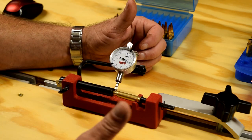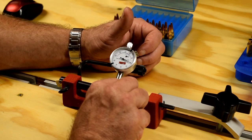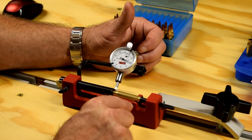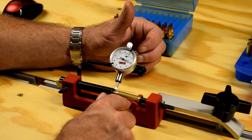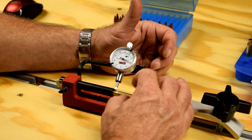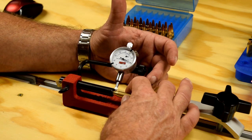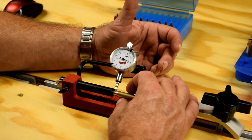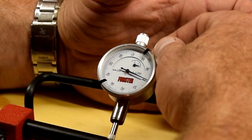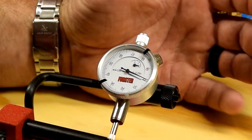I don't think zero for most of these measurements is that important — you're just looking for how far out it is. You can see the cartridge right now is not sitting down in the V. It's centered on here. If I pushed it down to the v-groove on this side, then it's going to be running a little bit on an angle and that's going to screw with your measurements a little bit. So that's one aspect of it I don't think is really well thought out. But anyway, let's go and spin it here. Every time I tighten it down, it goes off a little bit. Reading zero right there.